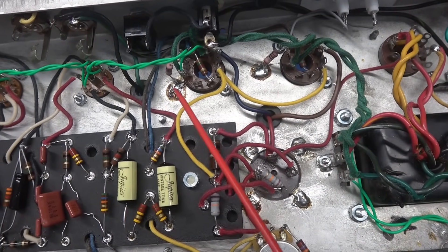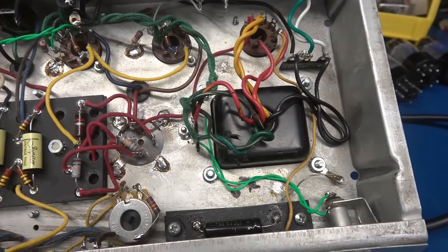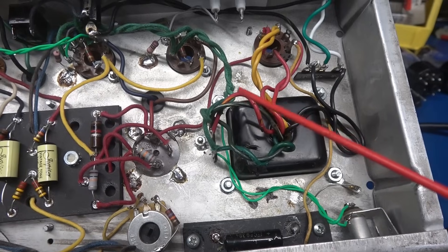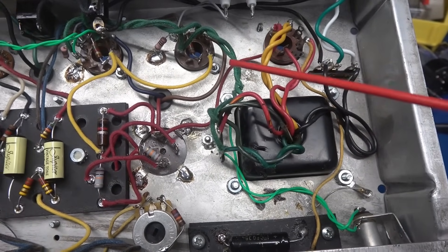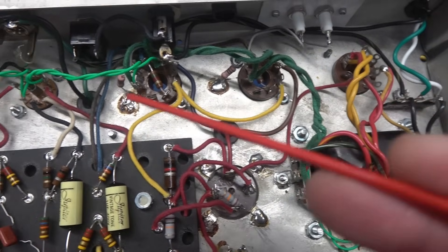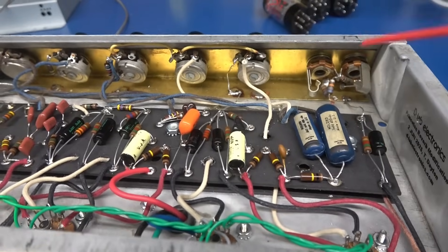This is the bottom of those Cinch sockets — I added the 1.5K grid stop resistors. These two 1-ohm resistors are for current monitoring of the output tubes via the rear pin jacks. My AC input and filament lines are now on terminal boards. I do this on the filaments because they don't like how they used to bring the high current leads to the lamp and back to the tubes. Now the filament lines land on this terminal board and feed the string of tubes, with 22-gauge wire going up to the dial lamp.